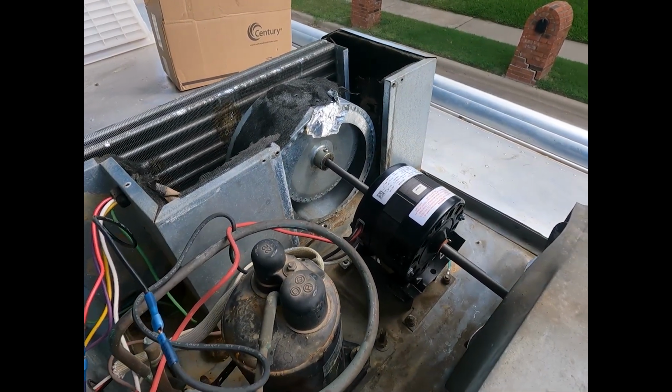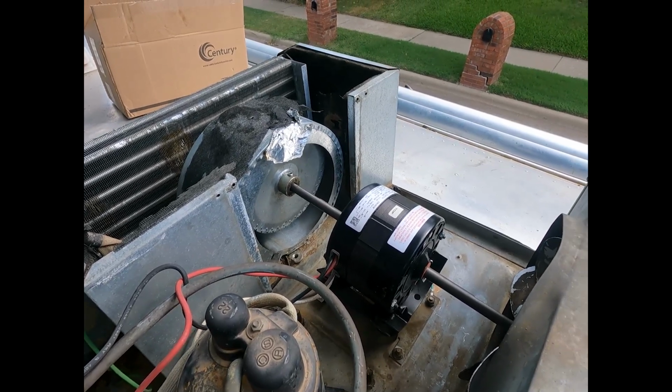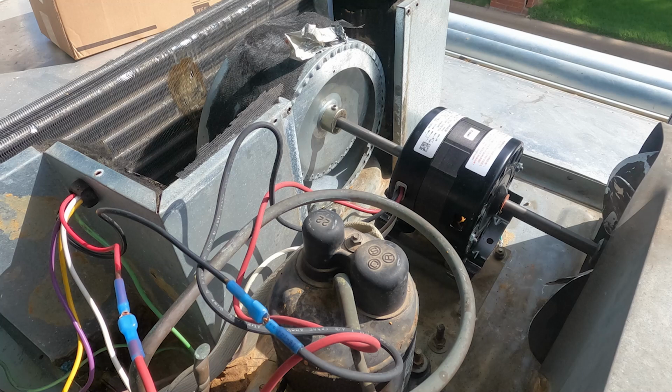All right, we were able to see Sin's fan motor running. It's tilted right now to get it to clear the housing. Well, Sin got his compressor all organized and the wiring done, and so here's where we will leave him. He'll still need to install that port door back there on the side of the squirrel cage fan, finalize his fan base mount to the casing, and then close up the unit. They say to be sure to mount all of your capacitors metal to metal and bundle them up with a metal strap, and then seal up the unit.